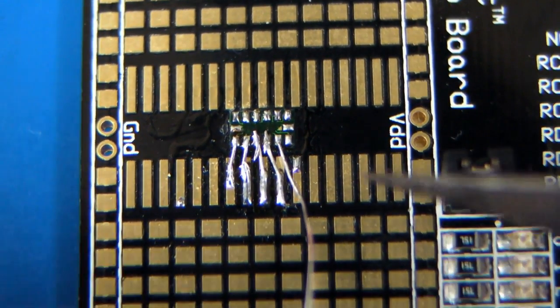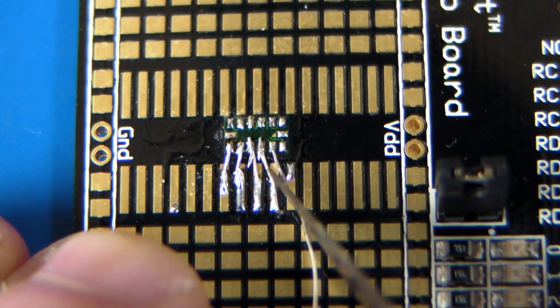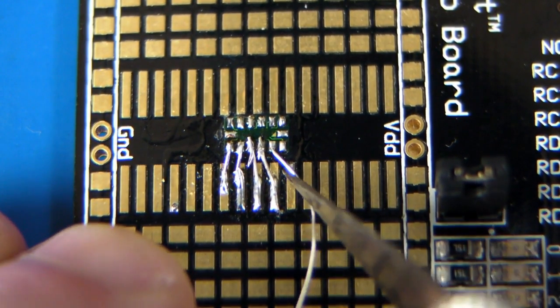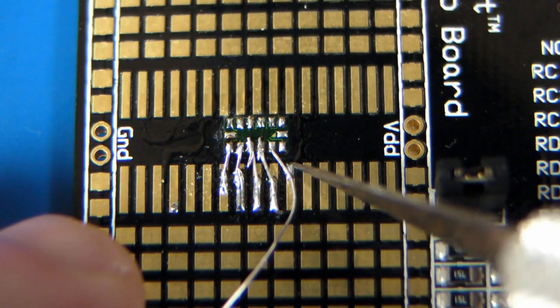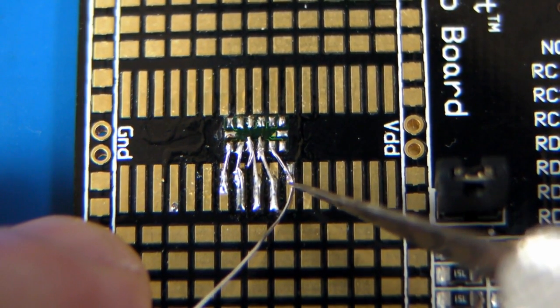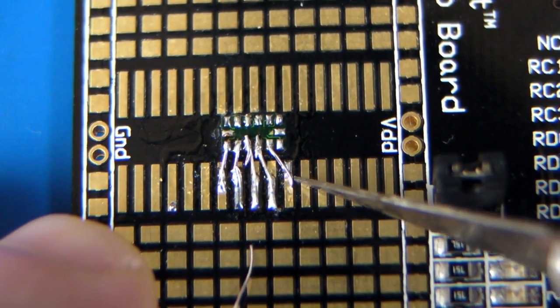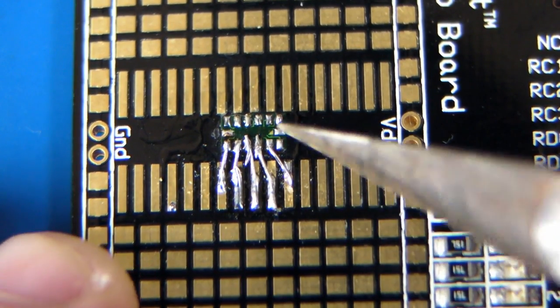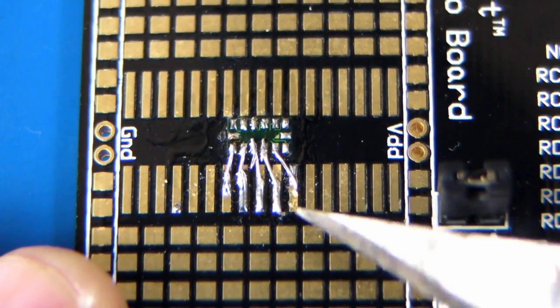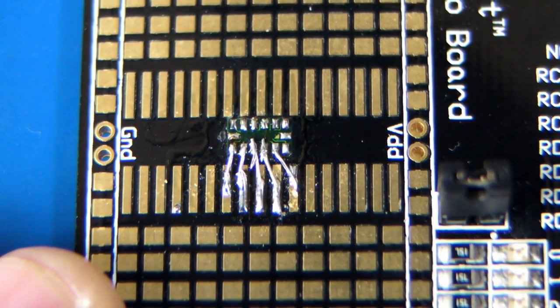This one here I've got to bend a bit further over. Don't bend it down directly because you don't want these to short — they aren't insulated wires. But it's pretty easy to solder them onto a larger diameter pad. Later on I will actually solder flying leads directly off these pads here onto my PIC chip.